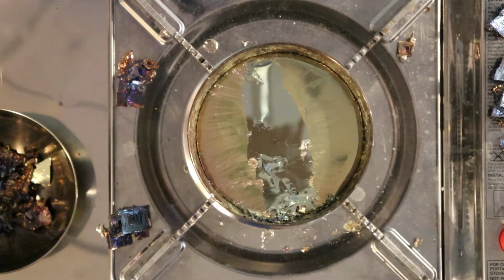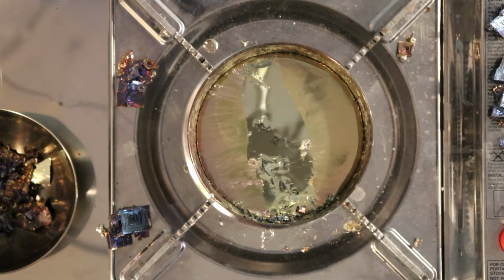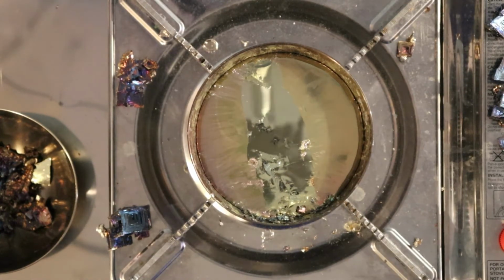so you might have a situation where you oxidize, if you've got molten sodium exposed to air, it just kind of catches fire. But if you had molten sodium and sodium oxide in a vacuum, I think you could probably get the sodium oxide to sink in the molten sodium. I could be totally wrong about that, but I think in general, the oxides are always going to float. And that's really convenient for all sorts of smelting processes, copper making, steel making, any time where you want to separate a metal from its oxide.